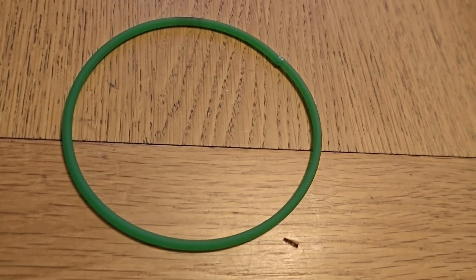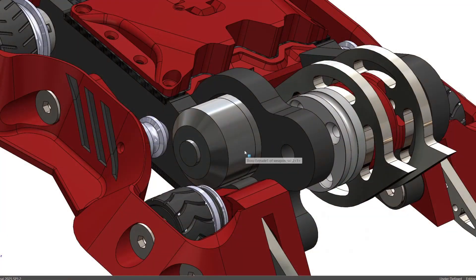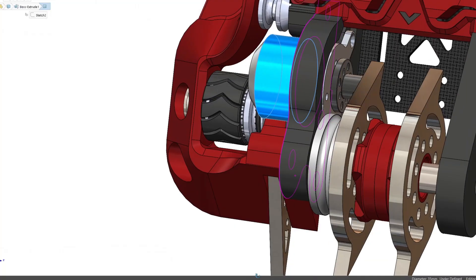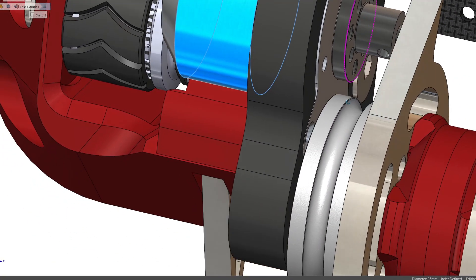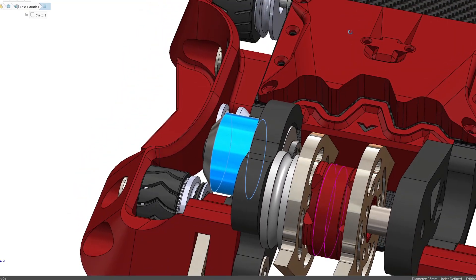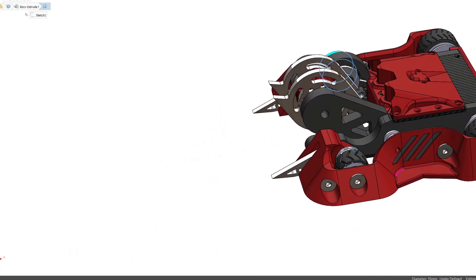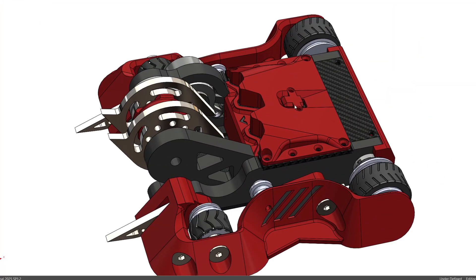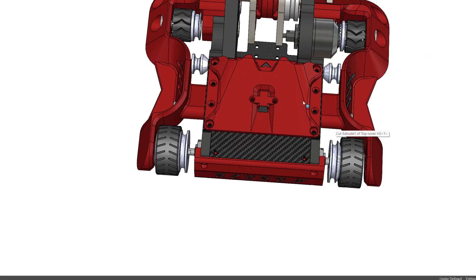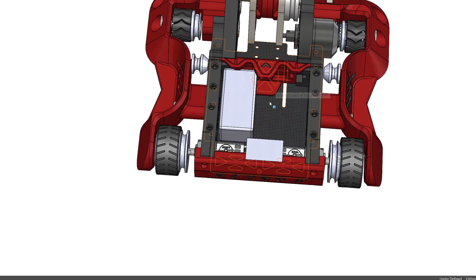I moved away from the really durable steel-cord belts to 4mm poly belt. This isn't renowned for being super durable, but it has more give and slip, so I hoped that extra compliance would stop the robot grenading itself if the belt took a hit. I also mounted the weapon motor through the 12mm HDPE main rails for much better support than the original bracket on V1, and swapped the articulating wedgelet assemblies for a single fork so they shouldn't get bent up and lose the ground game. Much of the rest of the robot stayed the same — same carbon fibre panels, weapon and drive motors, battery and control electronics.